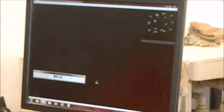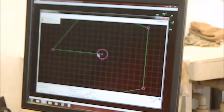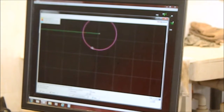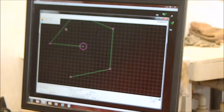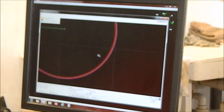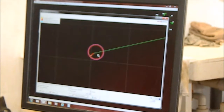Now we're going to generate the path, check for problems. Okay, it's showing, you saw that? It's showing big, bold red. That's showing that there's a problem, that the path is on the wrong side. However, in this case, normally there's an outside, normally we cut the whole outside piece out. In this case, the outside is already cut for us, so we don't need that. So even though it's indicating an error, actually it's not an error. We're happy with that. Yeah, we're good.